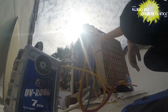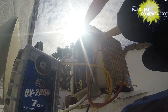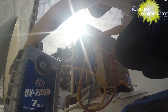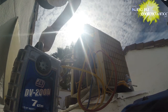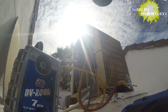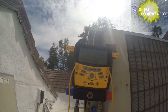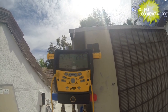Okay, so we're pulling 27 on the vacuum, 27.1. I'm going to go ahead and turn it off there, and we're going to see how we hold. And I can turn the vacuum off. Let's see if we hold, huh? I do believe we're holding. But it's going to take some time.